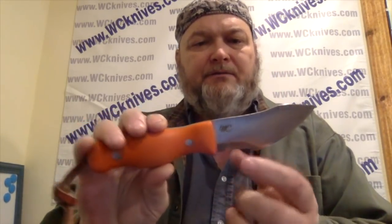That's the reason you see — and I'll show you this prototype as an example — different portions of the blade have different grinds. But I kept the cutting edge the same angle all the way through, because if it's hard to sharpen, then what good is it? I'm sure you guys don't want that either. So I kept the ease of sharpening throughout all of my designs. It may appear to have a different angle, but it's not — it's the same angle, and you sharpen it just like any other knife with curves.